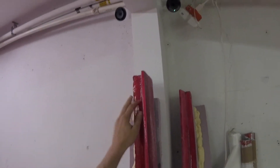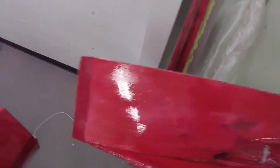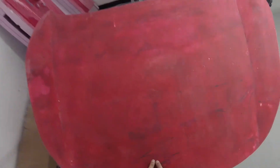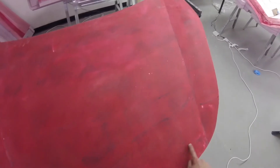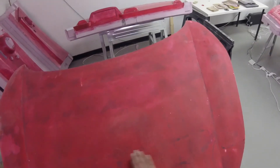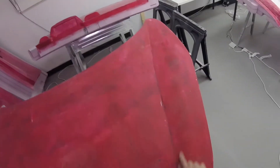The side sills are really not very good — I haven't put a lot of attention into these yet. It's also very hard to sand on the inside surfaces, so I have to fill in some of these sections. These are going to take a bit of time. The front hood came out pretty well. The foam was machined out of multiple layers and you can see where the seams matched, making a kind of warped curvature. So I took a ruler, ran it across the surface, measured areas that were below, and then painted on another layer of epoxy in all of those sections and sanded it down.